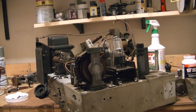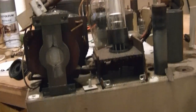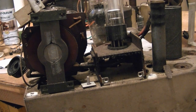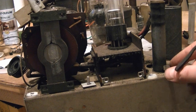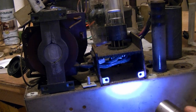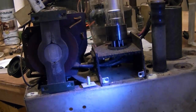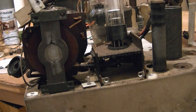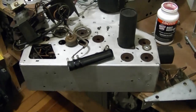Let's see — this is why I wanted to expose it, because this is just filthy. Especially down in here — a common issue is to start getting corona arcing down in there because all the dust gets attracted over the years. It's pretty bad, but a little brush and compressed air will take care of all that. I think that's looking a lot better now, and it really wasn't all that difficult to do.